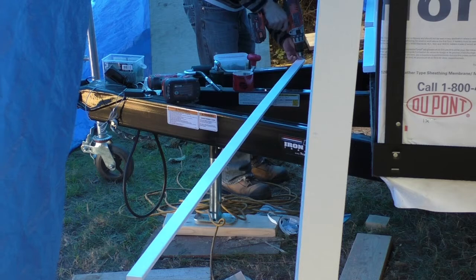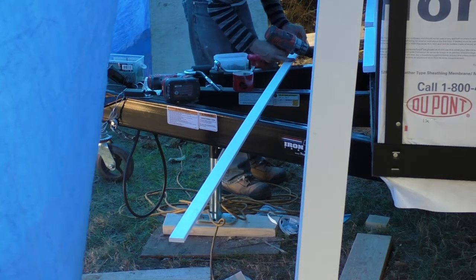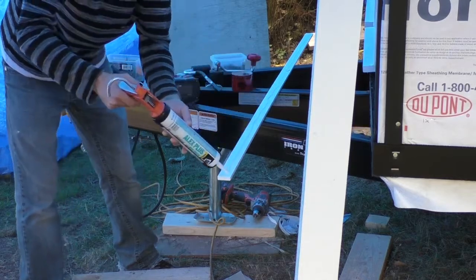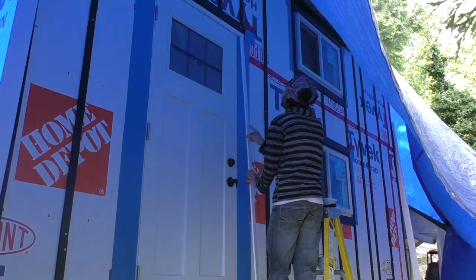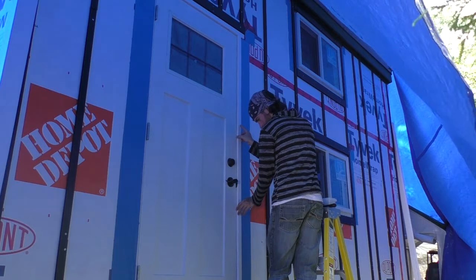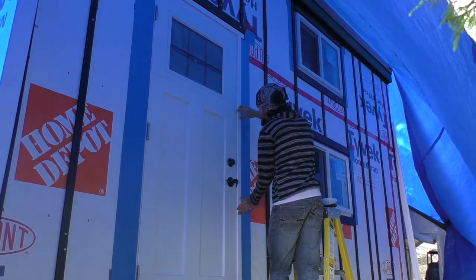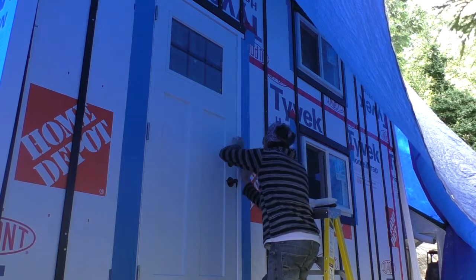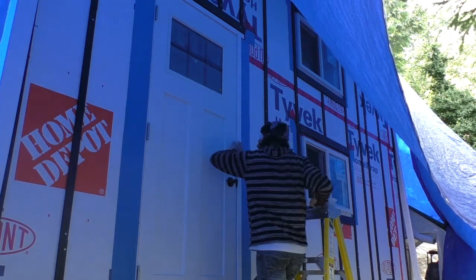After studying doors around my parents' house, I came up with a solution. The rain screen strips are 3/8 of an inch, and that's what the trim sits on. So I figured I could essentially make an appropriate brick mold if I just ripped a 1x2 down to 3/8 of an inch thick. A table saw is so important for this kind of thing. I had never used one before building the tiny house, but I can't imagine life without one now.